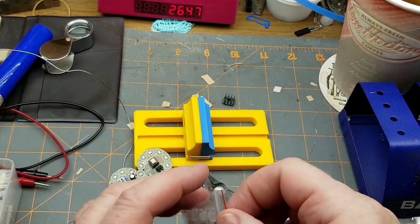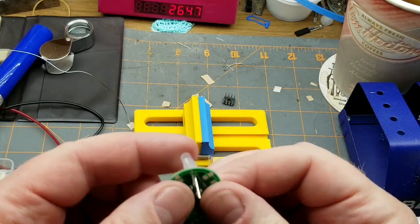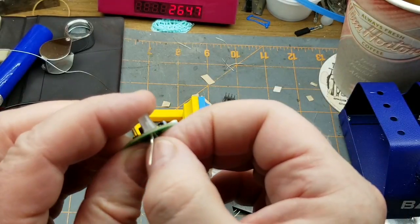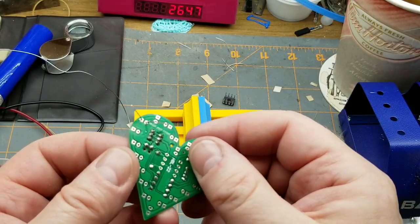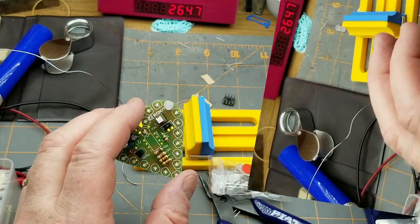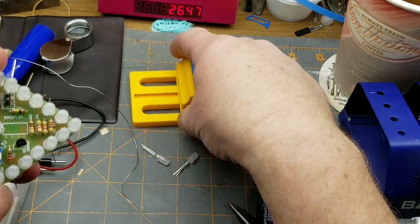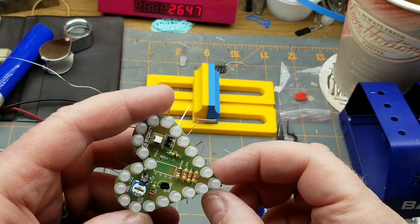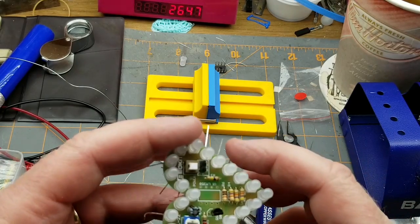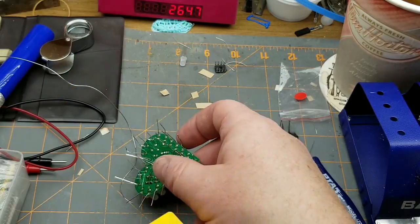Just the IC and a whole bunch of LEDs left. I'll stuff the LEDs in first — I'll push them flat to the board so they don't flap around. I'm going to take my time and blitz through these. Got all those guys stuffed in; there are even three extras, which is cool. Pretty confident I got them all in the right orientation. Let the soldering begin.